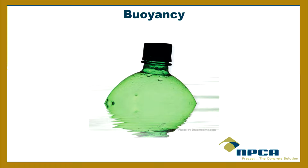That's very important to do, so there's a couple of things we can do. We can either add a thicker base to the bottom to add more weight, or we could extend the base out. That's been done, where the base is extended outwards to provide a shelf for the soil to sit on, which really helps keep it in place. Sometimes we've got to do that, but many times the tank by itself, due to its specific gravity, the fact that it weighs about 2.65 times more than water, is pretty good at staying in place. But it can happen.